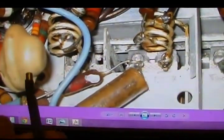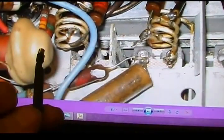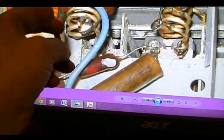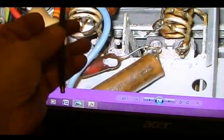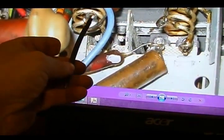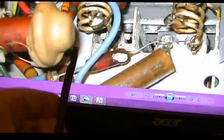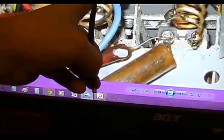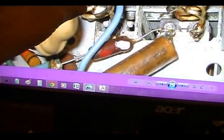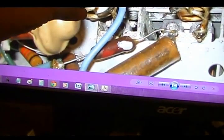And that was where we were talking about this little deal, where it's got a carbon on one end and a brass piece on the other end. You stick this into the coil. If your signal strength drops with either one of these going into the coil, then you're good. But if it rises, on any one of the coils, then, and I didn't bother to look at it again, I can't remember exactly, but I believe if you stick the carbon in and the signal goes up, then you squeeze these together. If you stick the brass one in and it rises, then you spread them apart, or vice versa.